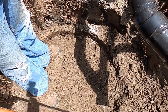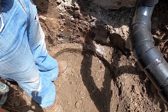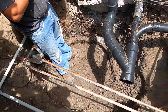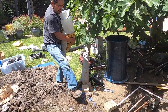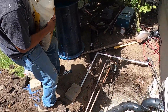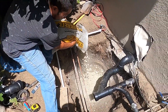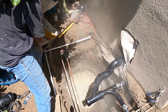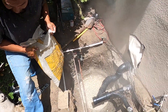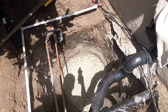We've dug a three or four inch trench around the circumference of the basin and we're going to put some gravel in the hole. That is to prevent the basin from floating up — this is an outdoor system, and if rainwater should get into that trench, the water is going to drain underneath the gravel and prevent the basin from floating upwards. It also helps us level it out a bit.